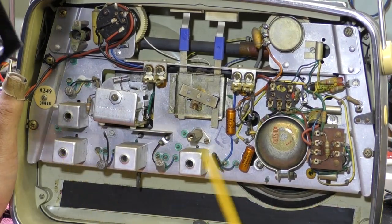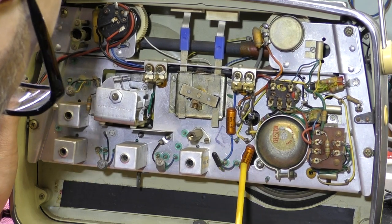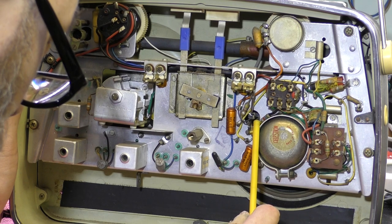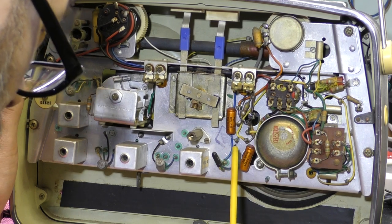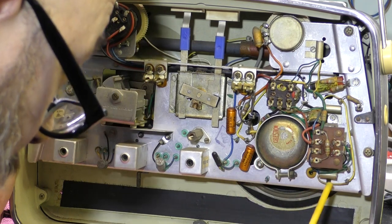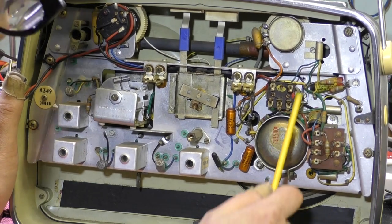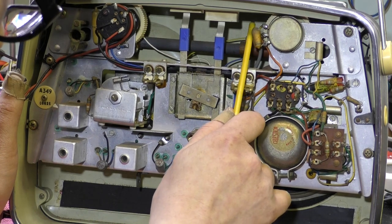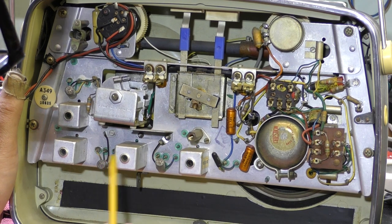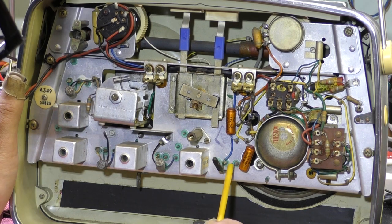What have we got in here? Looks like original capacitors to me. March 1963 on these two caps here. I guess that's the bias adjustment - one of those sliding carbon devices. That must be the driver, and the output transformer. These are probably the output devices. Why is the driver heatsinkd as well? That's a bit strange. Oh look - a waxy on the tone control. I like the way the transistors are nicely accessible though, mounted on these little insulators.